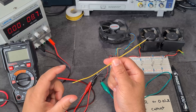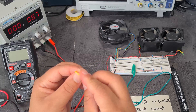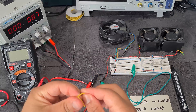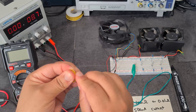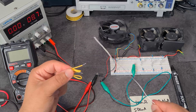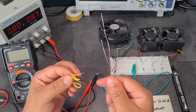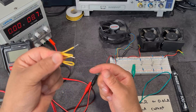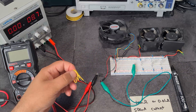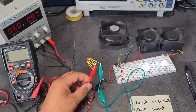I've cut the same length but this time with the insulating sleeve on it, so I can fold it up nice and small. If you used bare solid-core wire and folded it, you'd actually short out the shunt and the resistance would be a lot less than expected. With the insulated wire, you can have it nice and small so it doesn't really affect anything — and now I can just connect it into the circuit.